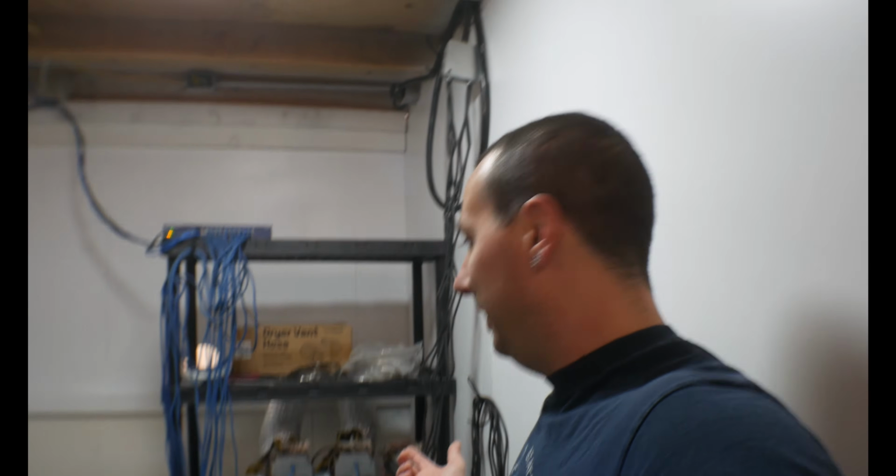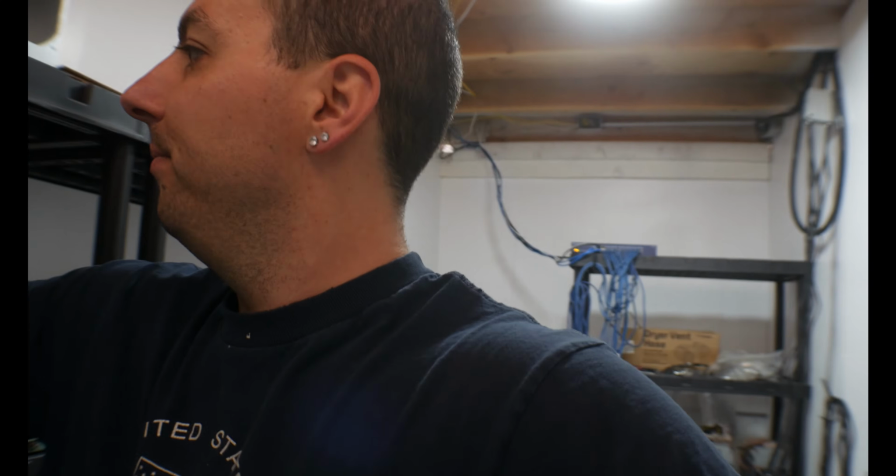And that's just super simple to do. If you use 6-inch ducting, like I said, it literally pops right over the outside of the fan housings. We have some housings over here, some fans. It just pops directly over the outside and stays on there, and then you can add a hose clamp if you want. There's the round area in between the two flanges where a hose clamp can sit if you really want to secure everything, just so a duct doesn't fall off. The ducts aren't going to fall off on that side. There's more of a chance of them falling out of the wall. But yeah, it works really, really well that way.